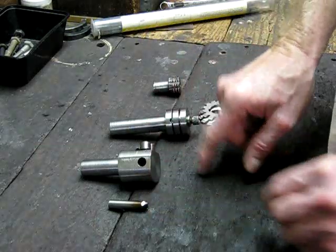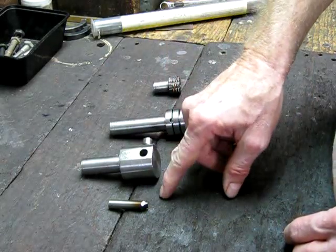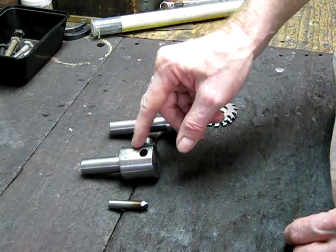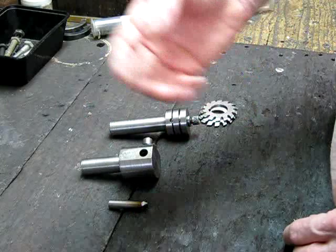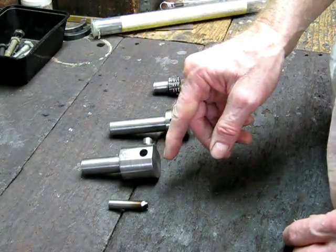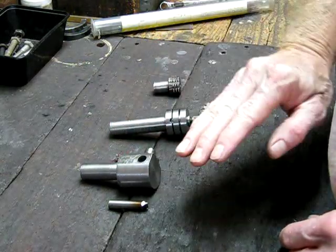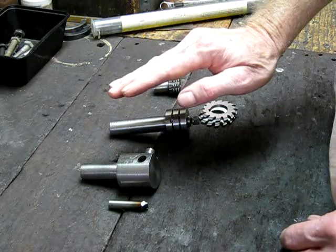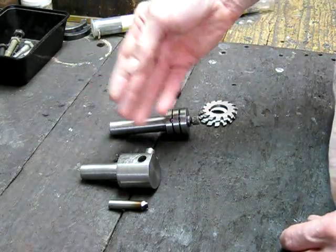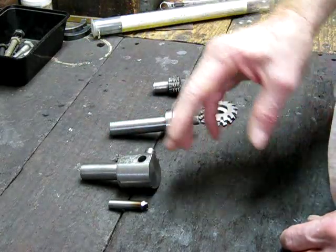That's your most basic type of cutter. The downside is it's slow because it's only cutting once per revolution, and it tends to give you some vibration because it's an irregular cut — a bit like having a circular saw with only one tooth. It does the job though; it's great for aluminium, copper, brass. You can do cast iron but you'll get a lot of shock loading, so not really recommended for small lathes.